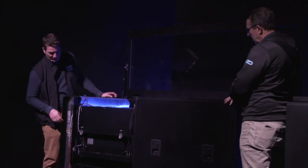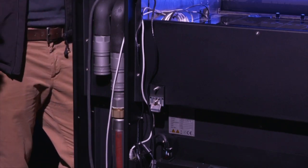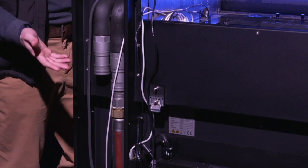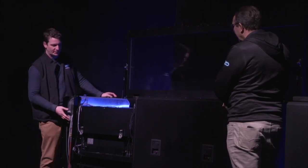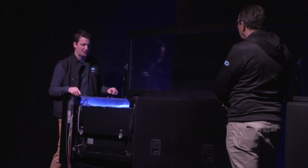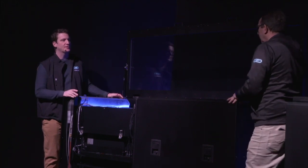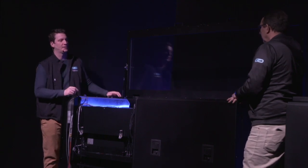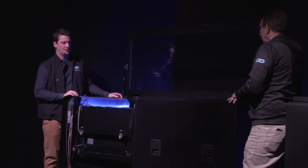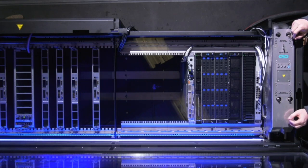Edgar, if you can help me disconnect one of the hoses so we can show. These hoses are pressurized — they supply water to the system in real time. That's how quick it is to disconnect one of these hoses. Obviously we take both of them out and we'd be able to extract the CDU in less than five minutes. That's what the whole system is designed for. The CDU is fully submerged in the liquid and cooled by the liquid itself, so all the electronics in a CDU are leveraging immersion cooling technology themselves.